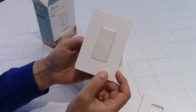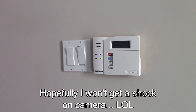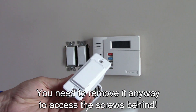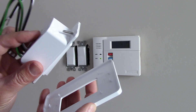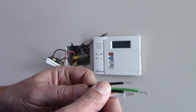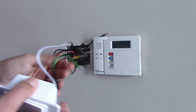So we're going to install this right now. This is the switch that I want to change — it controls the lights outside. So I'll put the TP-Link Smart Switch in that location. Since this is a double switch housing, I had to pop out the plate that comes with the switch, which was a bit difficult. The brackets are very strong, so you have to remove this to install it in a double housing. In the TP-Link light switch, you have four cables: the white neutral, the green ground, and the two black load or live wires, which I'm going to connect right here.